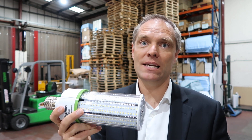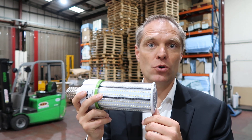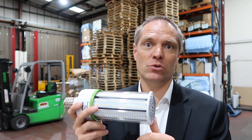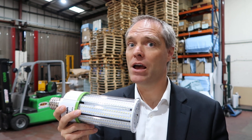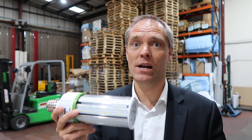When they're installed in this direction, you're only getting about 40% of the output that you need, and you're taking the lux levels from your metal halides from 120 lux to somewhere about 80 lux. Now that's really, really poor.